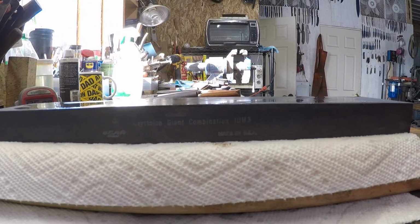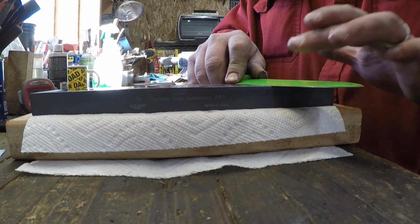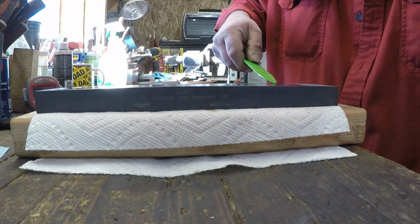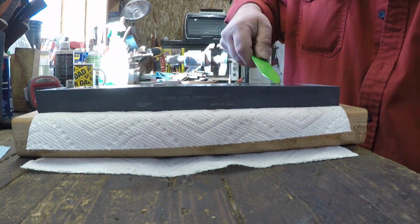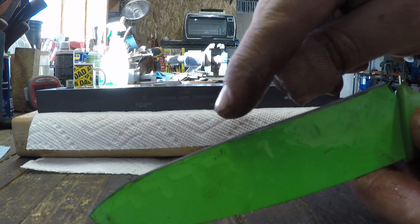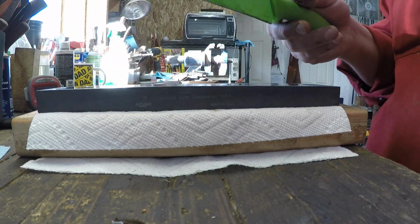All right, so in the beginning, when you're sharpening your first couple of practice knives, just try to match that factory angle. Either feel for the flat or mark it up with an ink pen or a magic marker, and try to use that magic marker as your guide as to whether to steepen up your angle or to shallow out your angle. That will get you in the ballpark for that knife.